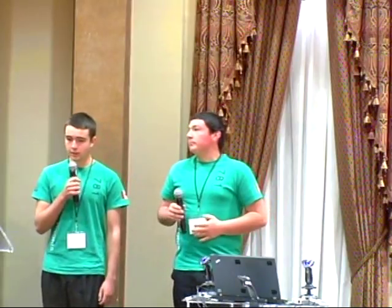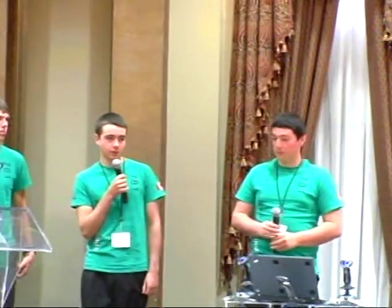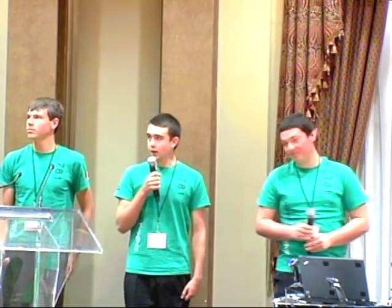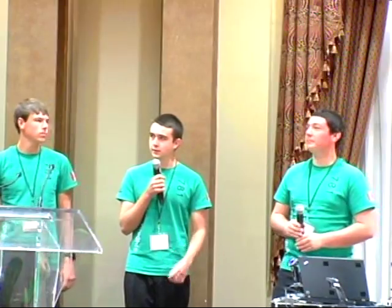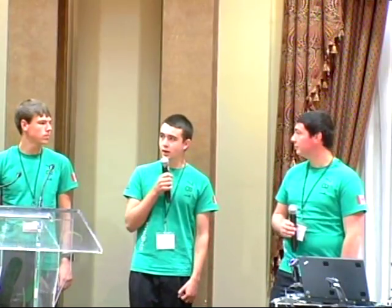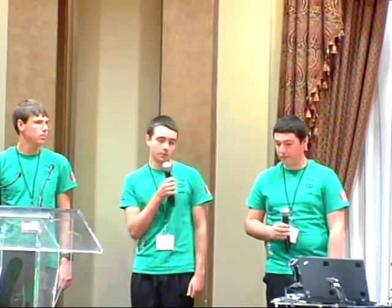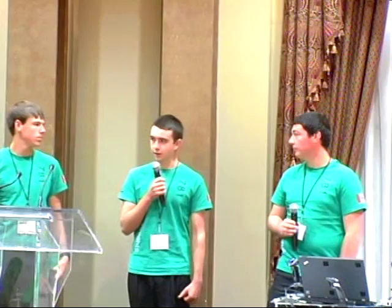So the robot that we designed for the 2014 game, we call it Big Bruce 13, which we also nicknamed Moose because of the antlers. Our speed ranges from about 6 to 18 feet per second. We have a max pushing force that we tested of about 250 pounds. Our control system is a National Instruments cRIO, and a 12-volt lead-acid battery powers this beast.